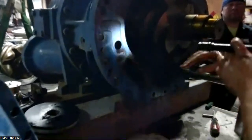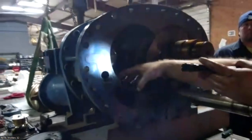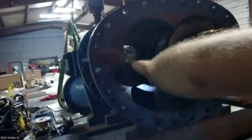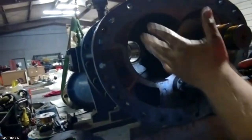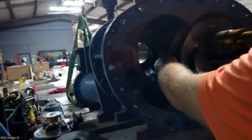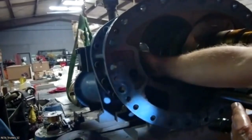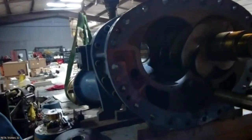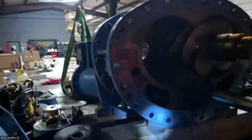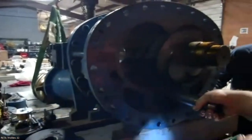If you look at this rotor housing, you can see a gap right here. That's where the gas is coming in; as it turns, it's pulling it in. Then it's sealed back here, again with the oil film, and it hits its compression down here in the very back, and that's where it's released. The ports you see on the side are for oil coming in to lubricate and cool everything. Fully unloaded, the valve is all the way in, going toward the discharge.